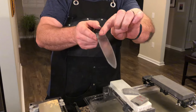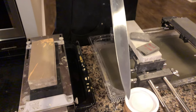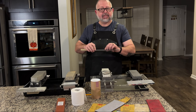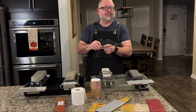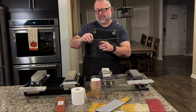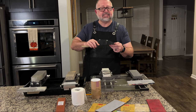The back side of this knife is hollow — it's literally curved. If you pay attention to the top, you can see a shine line around the edges that is different from the middle. When they were sharpening this knife they used a wheel spinning in one direction, removing metal, making the blade thinner and sharp. That concavity on the backside is ground in a specific direction, which is why the edges have a different shine and finish.